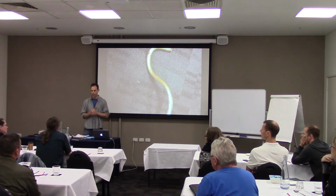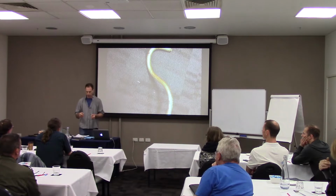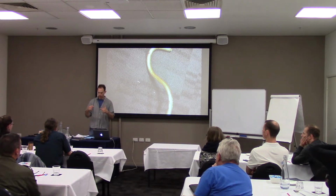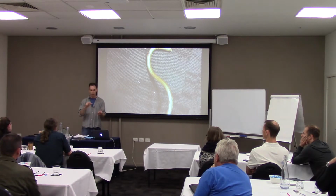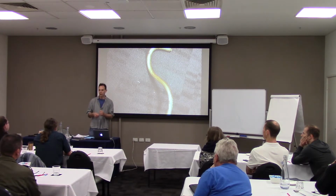How do you do that? Oh. Cut a disc or? I cut a disc out, and then I get it going, and then once you get it to a certain point over, then you can trim it out. But I take a cutter with an insert. It was basically a bar that I chucked up in my tool holder, and it's a polished, rounded end. And then I put some grease or wax on that, and then I just drive it in with my feed, and then get it in around the corner, and it'll make a beautiful edge on your pad cup. So cut roller bearings, ball bearings there?